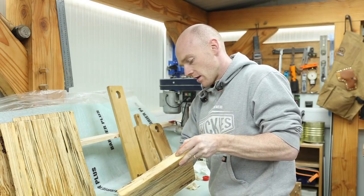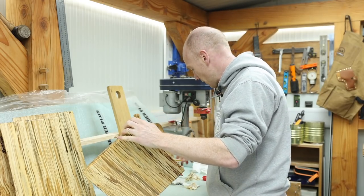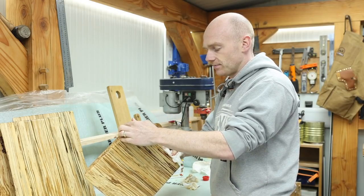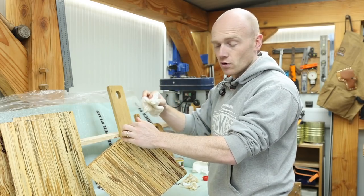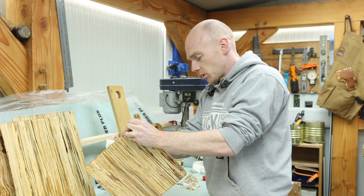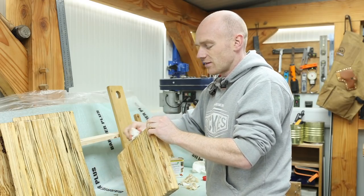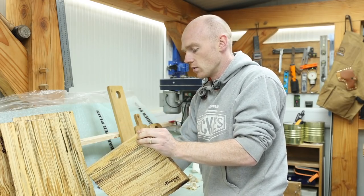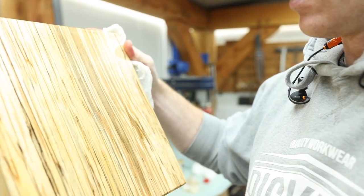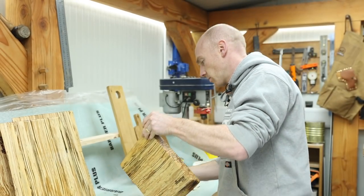And by just going with the grain, it's getting the streaks out. So when you first put it on, you can go a little bit thicker. But if you left it to dry like that, it doesn't soak in like a pure oil, because this is slightly thicker. It's more like one of their wax oils. So I'm making sure that when I wipe it, I'm going with the grain and it'll leave it nice and smooth. I don't think we'll need to sand in between. A bit of wire wool is quite good. This is the matte one anyway, so we shouldn't get too much of a satin gloss look to it. So it should finish nice and smooth looking.